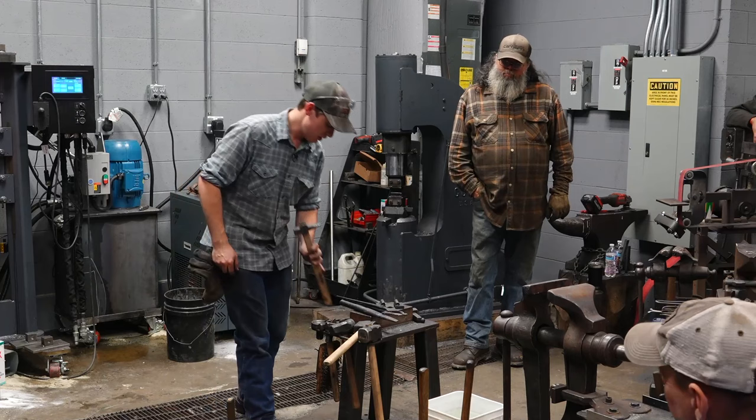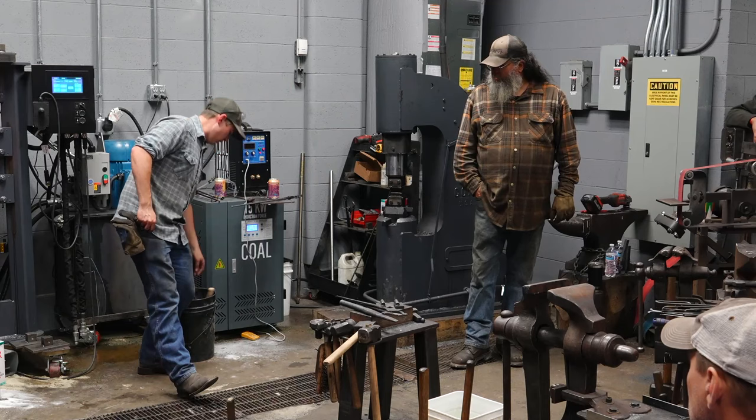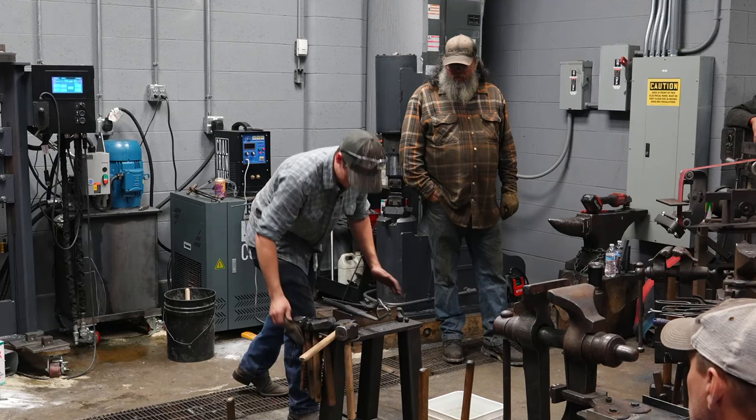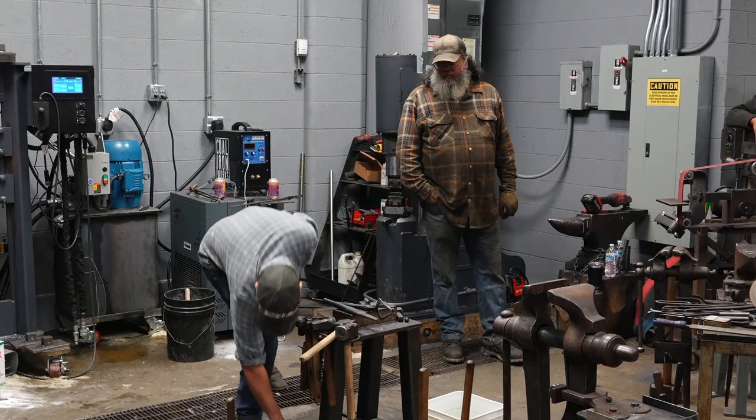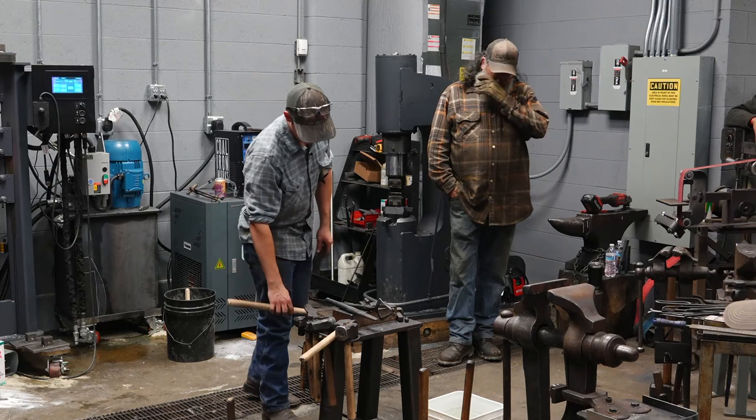So yeah, I made all these tools with someone, or like, here's a tool that Quad State Mark Ling made me, because I needed one. As far as the radius, it's a very good question. The fullers, they need to match, right? So the smaller fuller that needs a new handle, smaller fullers are about 5/8 of an inch wide and 1.5 inch radius. So top and bottom are the same. I usually make these at the same time, a top to match a bottom, and they go together.